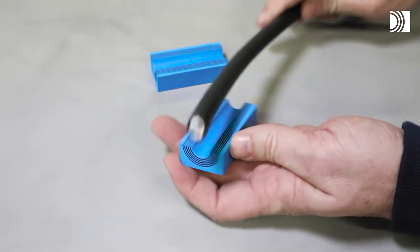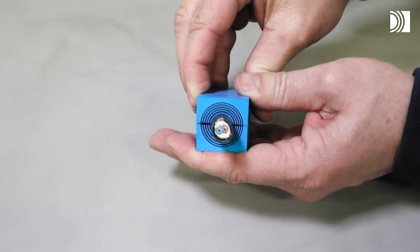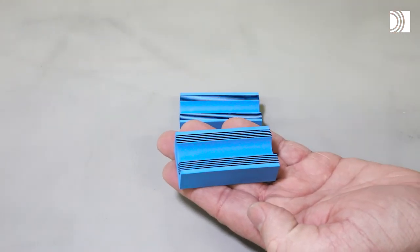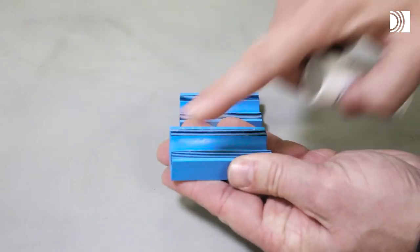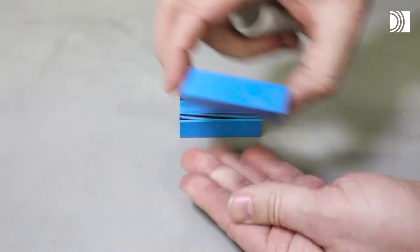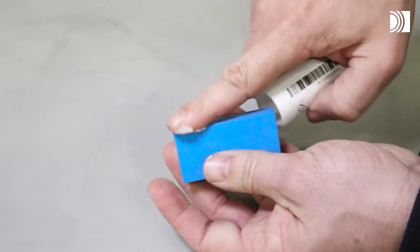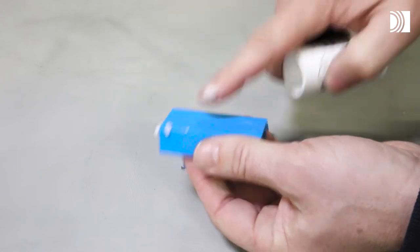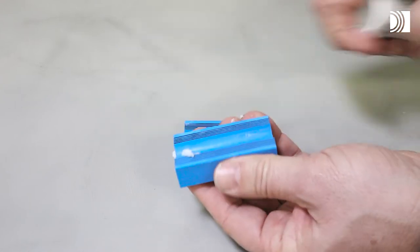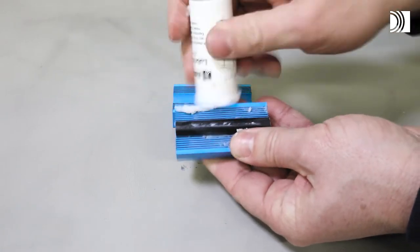Achieve a 0.1 to 1.0 mm gap between the two halves when held against the cable or pipe. The number of layers may not differ by more than one between the corresponding module halves. Lubricate all sealing surfaces on the modules. Lubricate the sealing surfaces of the spare modules. Do not remove the core.